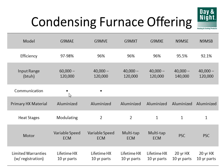The G9MAE is a communicating furnace, and we'll talk more about that toward the end of the presentation. Communicating means it can communicate to a controller on the wall in lieu of a regular thermostat — instead of normal G, Y, and W signals, it sends a communicating signal from the wall controller to the furnace to tell it how far you are from set point, how much heating capacity you want to modulate the gas valve, and can also control some condensing units that way.